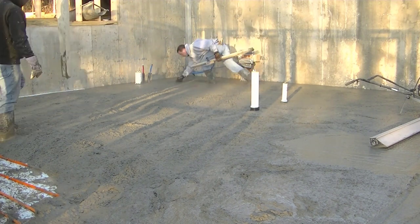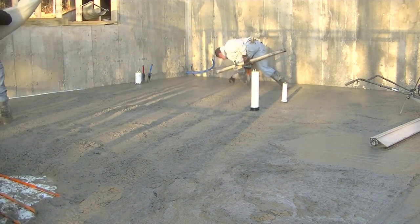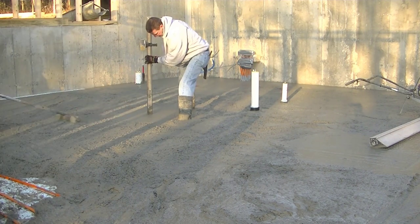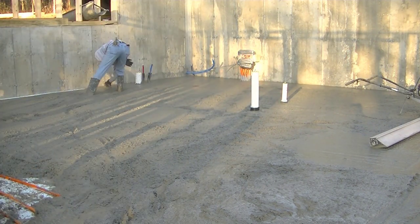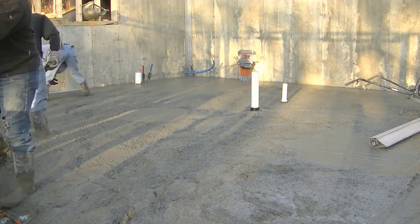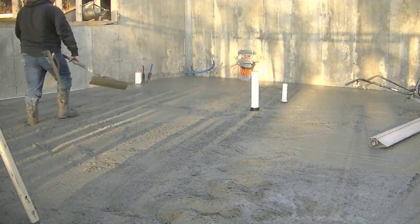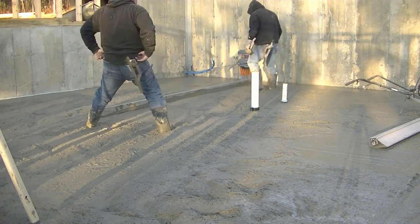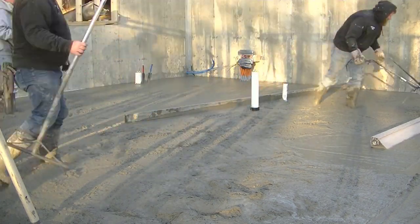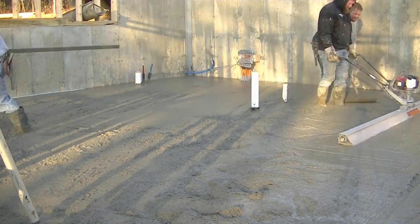The slab will stay above 60 degrees for quite a long time even if outside temperatures are in the 40s. Once the concrete temperature gets down to about 40 degrees, the heat of hydration almost stops — it slows down tremendously. You'd be sitting on this thing all day and into the dark trying to get a good power trowel finish on it, and that's something we don't do anymore. This floor we power troweled and saw cut, and we were all done saw cutting by 2 o'clock in the afternoon.